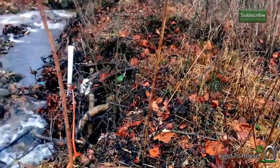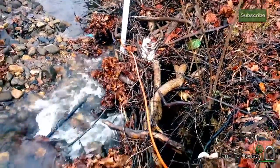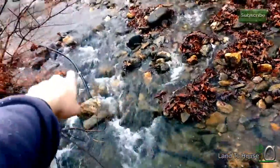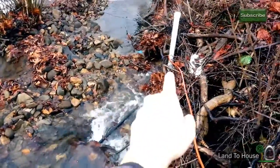So here's the installation. We have the ram pump down there, a very short drive pipe — this is an extra piece here. It's about 20 to 25 feet to the pump. It's a one-and-a-quarter inch size, and then we'll follow the delivery pipe, which for now is just a regular garden hose.